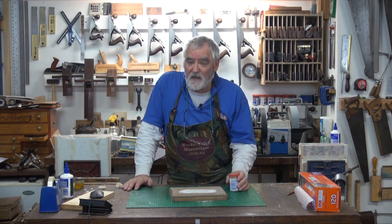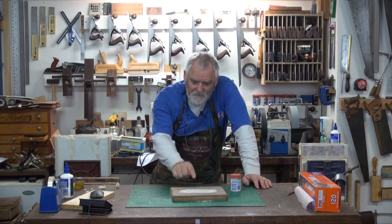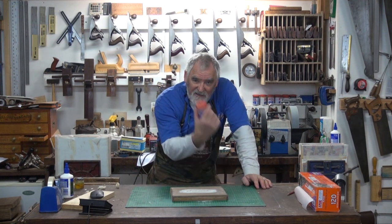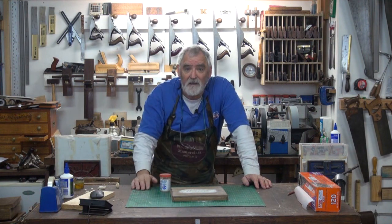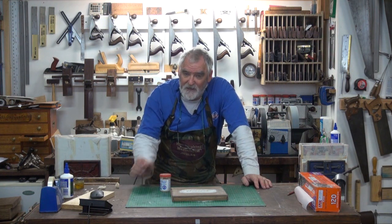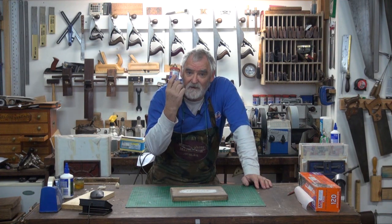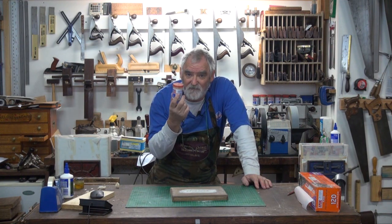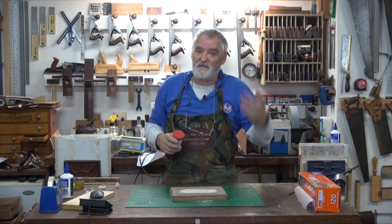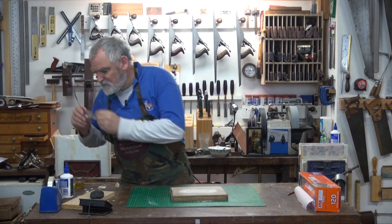A lot of the spirit-based ones I've used in the past — you can match them to the colour of the timber, but then when you spray your timber it darkens and the putty doesn't. That's another trick: if you're going to use wood putty, put a coat of whatever finish you're using on before you put the putty in and match it to the darkened colour of the wood. When you finish putting a finish on, the water-based ones don't change colour whereas the oil ones do.